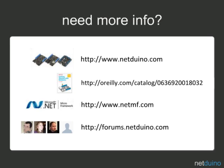I would add to that, garbage collection is something that's been around for a while. It's pretty much mastered today. And there are different generations in garbage collection. You talk about generational garbage collection, where you have short-lived objects that get collected very fast and very often, and then you have longer-lived objects. And I think in .NET there are 3 generations.